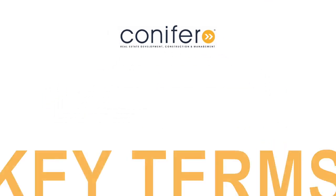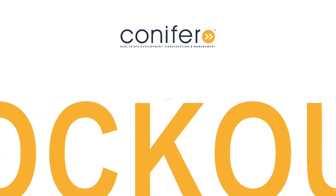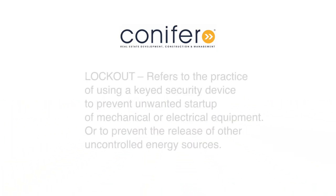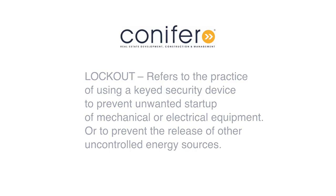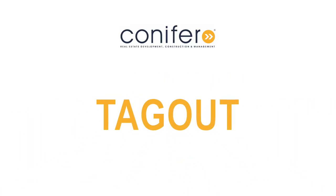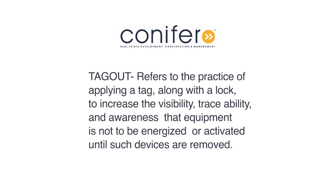Before we go any further, let's go over some key terms. Lockout refers to the practice of using a keyed security device to prevent unwanted startup of mechanical or electrical equipment, or to prevent the release of other uncontrolled energy sources. Tagout refers to the practice of applying a tag, along with a lock, to increase the visibility, traceability, and awareness that equipment is not to be energized or activated until such devices are removed.